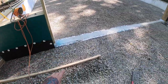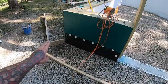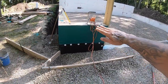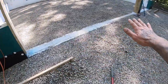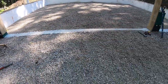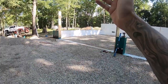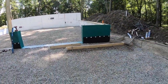Here we started framing in where the apron is going to come out - it's two feet off of the house. It's pitching away this way, pitching away this way, and pitching away this way, so both aprons in the corners will have all of the water getting away from the house in both directions. The aprons throughout where the doors are will only slope away from the house. I purchased all of the framing lumber for the entire garage - the windows, the jack studs, the cripple studs, and the LVL headers for above the doors.